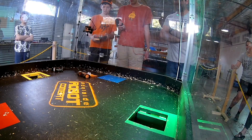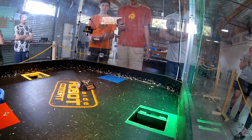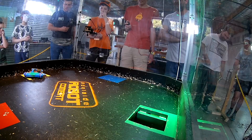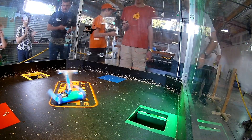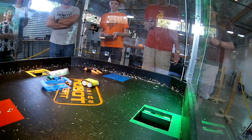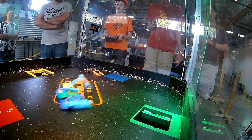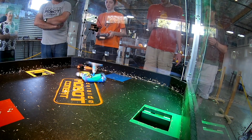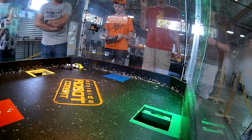Now that the pits are open, we've got a good chance of actually pushing people around. I managed to drop somebody in the pit, but unfortunately they dropped my partner Jayden in at the same time. I then grabbed hold of them and the servo isn't quite doing what I want — but it does manage to release and that leads us to the win. However, that win came at a big cost: that servo, running on lipo voltages, stripped its plastic gears out, which meant that in our next fight I didn't have the servo moving and I didn't have time to fix it. So that fight didn't go well and I ended up in the pit.